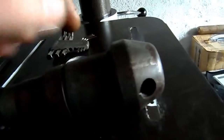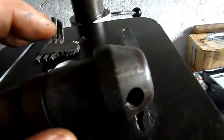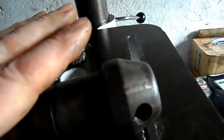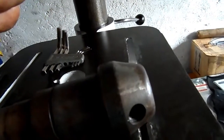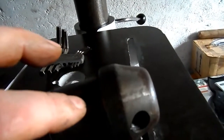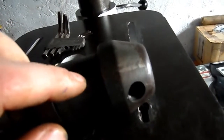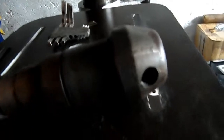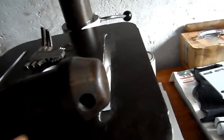They had the top part and then the bottom part at the rear, and it had sheared. It had been sheared for a significant period of time because the metal across the plane where it had sheared was very dark in colour, suffering from some corrosion and staining. So it wasn't the action of driving the pin out that caused the shear. It would have needed replacing. Otherwise, it could have possibly caused damage to the inside of this union of these parts. It's not a big deal, but it's just one little thing that I've identified.